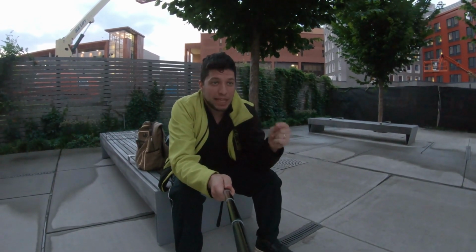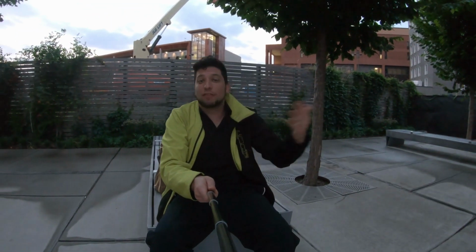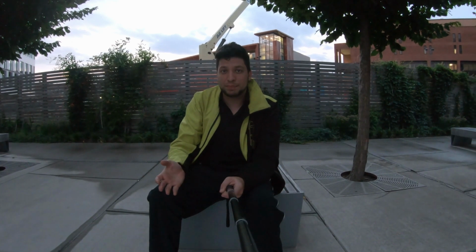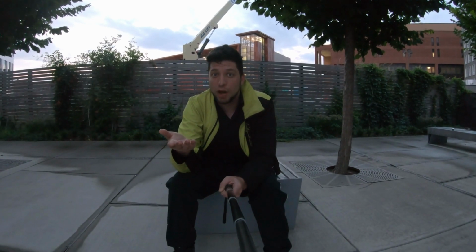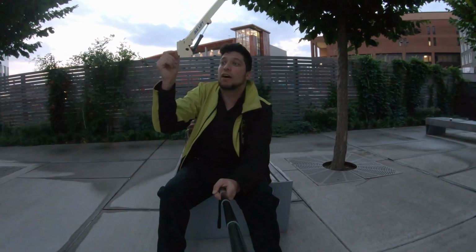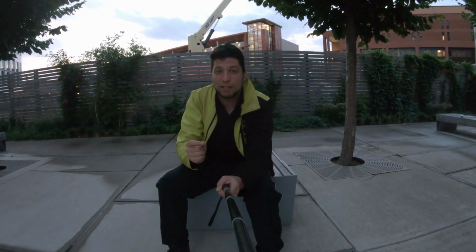So what does that mean? Well, a normal household outlet, something that you would find in every house across America, your normal 3-prong outlet, is a 110 volt outlet. So both chargers are going to work just fine in your normal household outlets. However, high capacity outlets, something like, for instance, when we're talking about electric unicycles, an outlet that might be coming off of an electric vehicle charger is actually a 220 volt outlet.